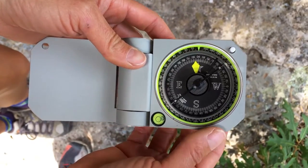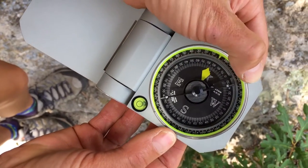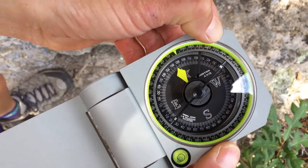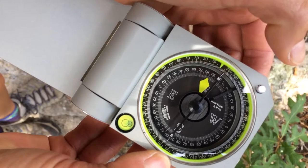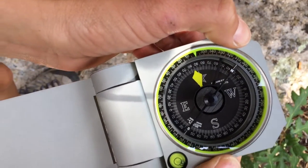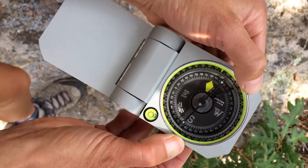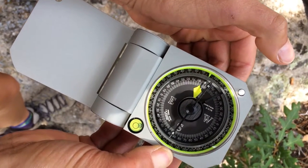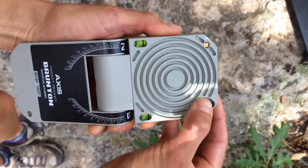The needle button is similar in function to that of the Brunton Geo. The magnetic needle is normally locked, but when you press the needle button, it allows the needle to rotate and reset itself. When you release the needle button, the compass needle locks into place. This new rare earth magnet needle is quickly dampened and is quite accurate even when the compass face is slightly off level. A recommended method for accurate bearings is to slowly press and release the needle button three times with each new measurement — that's sufficient to get it to lock into place for an accurate new reading. If you don't like this default needle setting, it can be disengaged using the adjuster on the compass base.